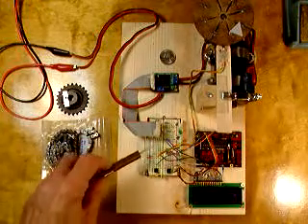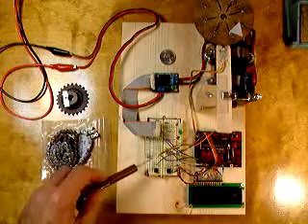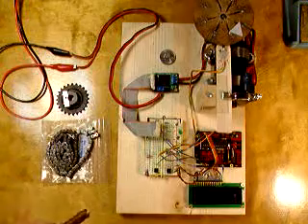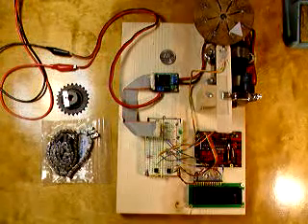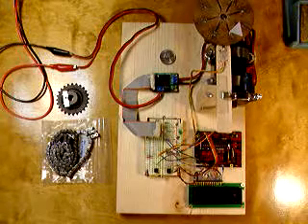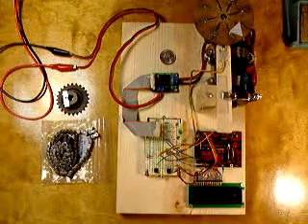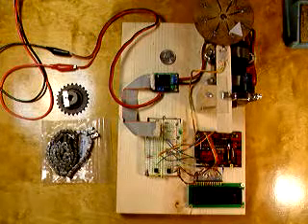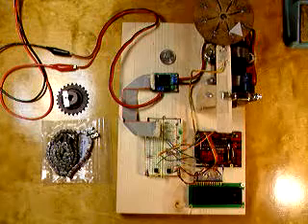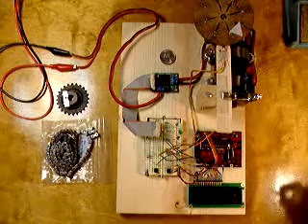This small board is a protoboard, and it has the switches to control the direction in the menu. This is a motor controller from Pololu — it has a VNH3SP30 driver chip on it. That chip, which is smaller than a quarter, can switch thirty amps. Although this motor only draws about two amps, I expected it to draw maybe five or six amps at startup, so I needed something more than the common controllers you can get for the Arduino.